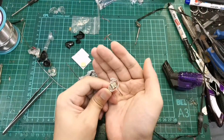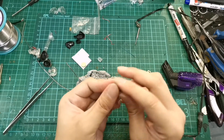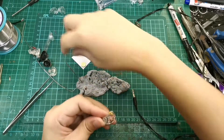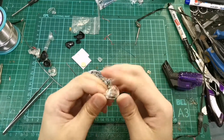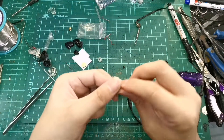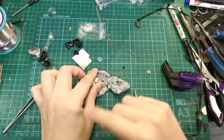It's locked in nicely and it's not going to fall out. Now we install the connectors and fit whatever is needed inside, like the capacitor. After this step we can close up and finish the job and glue it up, but we actually need to test first. After this step we just need to install the damper and do the same for both sides. Give it a sound test — if you have a measurement mic, use it to make sure it's balanced. To close it up, just use super glue applied with a needle, one round around the edge, and you're done.